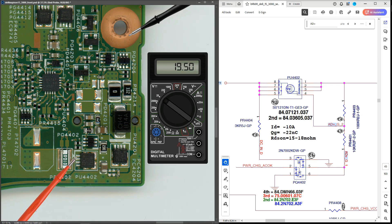That tells us that our whole input section looks to be working. Our 19.5 volts is coming through the first MOSFET, through the second MOSFET, and I've actually measured past the current sensor resistor — we've got 19.5 volts, so our main power rail is fine. I tried to power it on at this point but literally nothing happened, so next I'm going to check for my 3.3 volts and 5 volts always-on power.